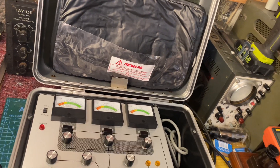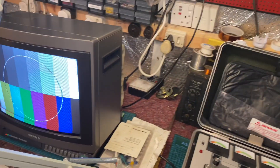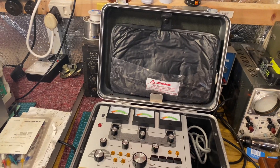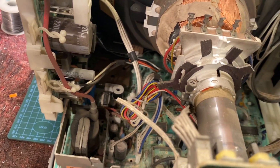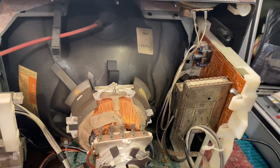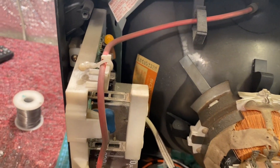We're going to see if I can make use of it on this CRT to check it. I don't have any of the information but it's easy to set up the cutoff, G2 volts, and the G1. The first thing we're going to do is disconnect it, unplug the SCART sockets, discharge the tube, and hook it up to the CRT tester. It's not actually that filthy inside — none of that cigarette tar stuff. There's the audio chip — this does RF front end and audio. That's how we set the drive for the red, green, and blue cathodes.